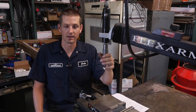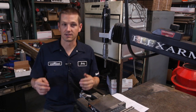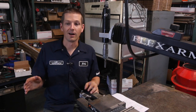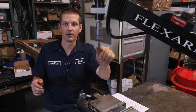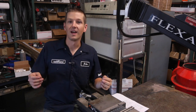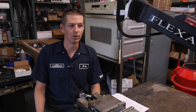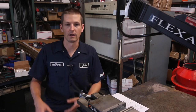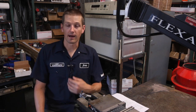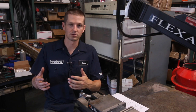I don't have one yet, but I've got to get a Jacobs Chuck adapter for deburring. Clean deburring is huge. And when it comes to tapping, it's a little bit ironic because on the Tormach, yes, you can use a tension compression head and do that fine. But I can't tension compression tap half-13 like this tap right here, and you can't tension compression tap blind holes. This thing clutches out — awesome. Tapping is usually the end of your run, and the last thing I want to do is scrap a part or break a tap. It's disruptive from a business and operational standpoint, and it's demoralizing. Tapping offline for us is great because it reduces the risk.